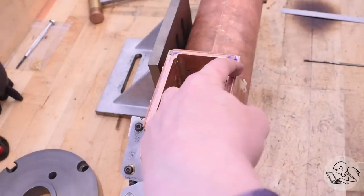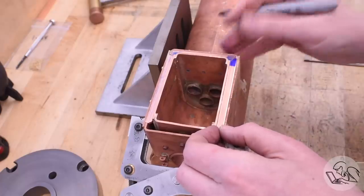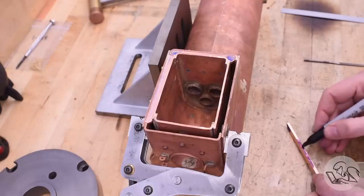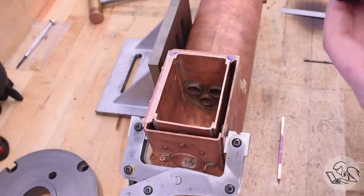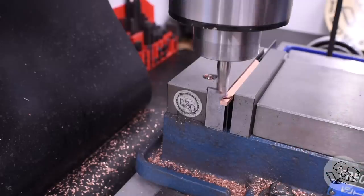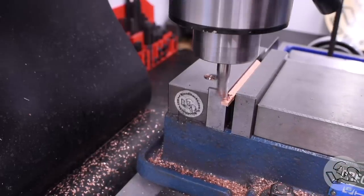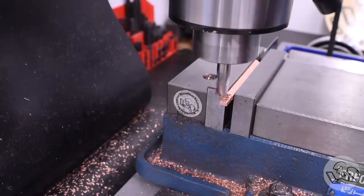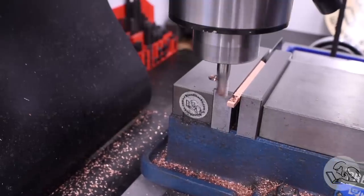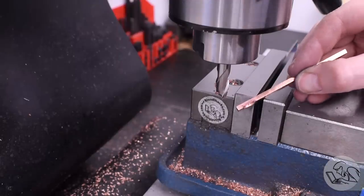Another technique I found helpful: if there's a particular spot that's just a little bit tight, I mark that area with the Sharpie, then just file off the Sharpie mark and test fit again, marking the new area wherever it's tight. The piece on one side also needs a little clearance cut for the blowdown bushing — this is part of Kozo's design. He has that blowdown bushing really far down and expects you to cut a little clearance out of the foundation ring piece on that side. I actually needed less clearancing there than Kozo's design because I moved that blowdown bushing up a hair — I didn't like how far down it was.